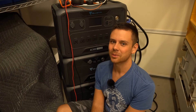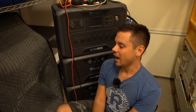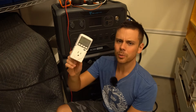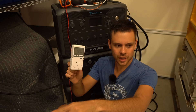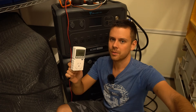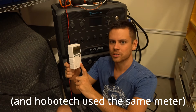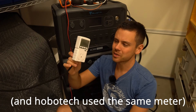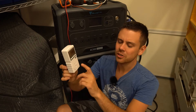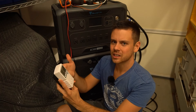I pulled 87 percent from mine and practically the same as my full-size system, so that's weird. Some people try to criticize these power meters, but my shunts are practically the same accuracy as my CBA4 system with amplifier. These meters are accurate down to about 0.1 watt, so when you're testing large batteries with something this accurate you don't really need to doubt the figures.